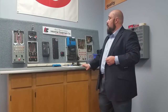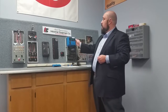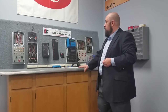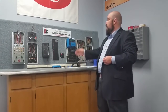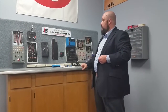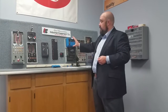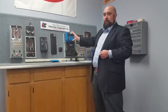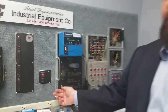It's in initiation mode. The operating control is called for heat and is getting started up. Safe start check — it's now checking its own internal circuits to make sure everything is working fine. Then it opens the pilot, lights the pilot, opens the main, lights the flame off the pilot, and we are now in run mode. As you can see, that happens very, very quickly.